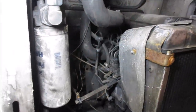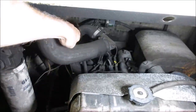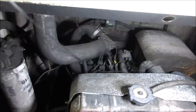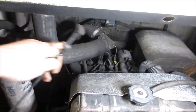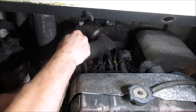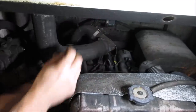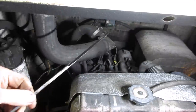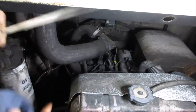Let's pop that oil dipstick out real quick. There are gauges and controls above this area — they're all written in white marker. The dipstick reads way, way overfilled. I don't know if that would be diesel going into the crankcase. We're supposed to be down here on the stick but we're way up here. We'll keep that in mind.